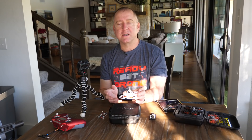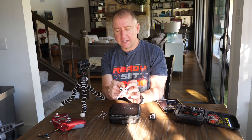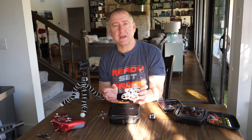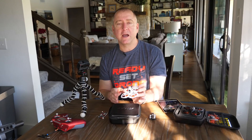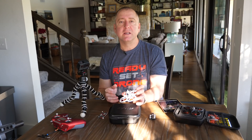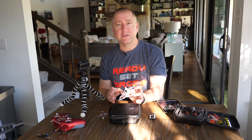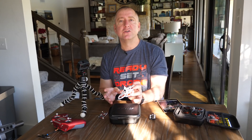Two questions you may be asking: why do you have to unlock it, and why not just make it 200 all the time? The first reason is that in some countries, transmission at 200 milliwatts is actually illegal for communications reasons — like in the U.S., it would be the FCC. The second reason for adjustable VTX power is that if you're racing with other people and everyone is running 200 milliwatts, they tend to interfere with each other. If you have a whole bunch of people racing, you really want to keep it at 25 milliwatts because there's less interference and crosstalk between video transmissions.